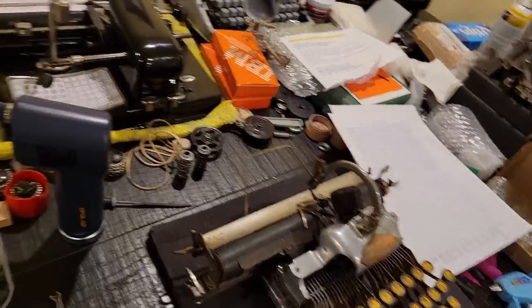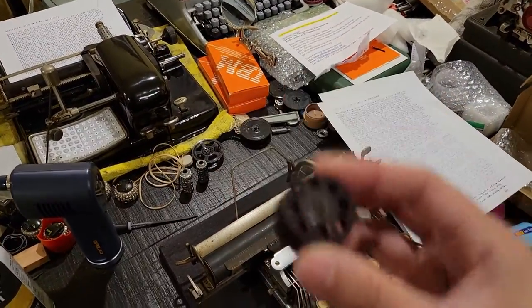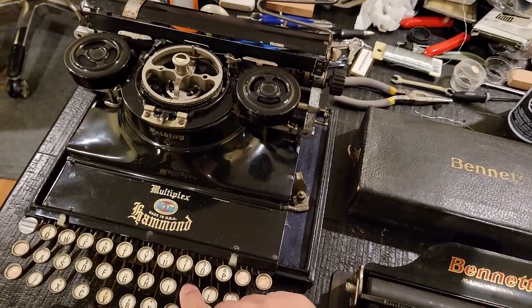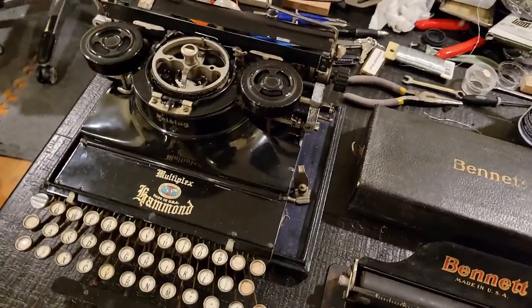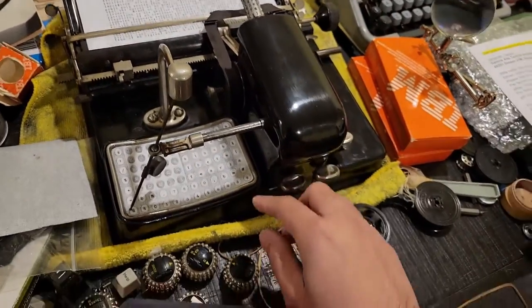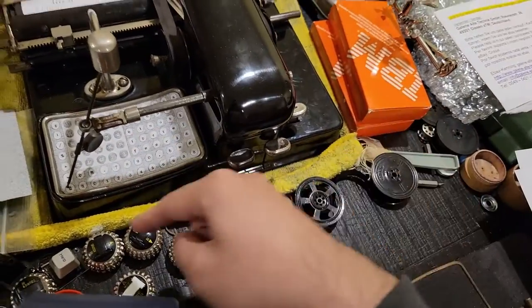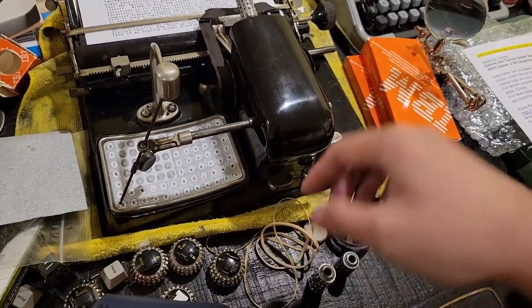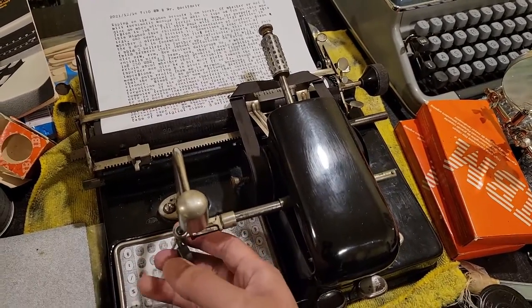And eventually companies like Crandall and Hammond came about also, producing probably what would have been the first of the single element typewriters, where instead of using those type bars, they would use these. So this is a 1925 Hammond, folding Hammond, one of the last of its kind, well, before the Verityper company came into being. Then the Crandall would have been more similar to this machine, the Mignon, which I covered in the preceding video, except that instead you have a special two-row keyboard, where each key press will automatically move and rotate this cylinder, which will then strike the paper.